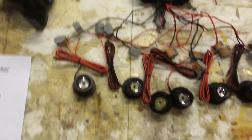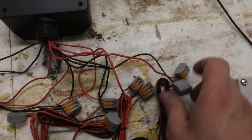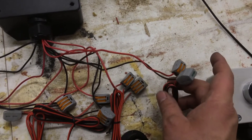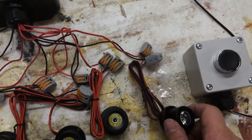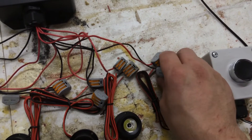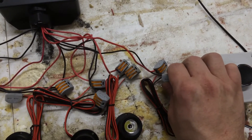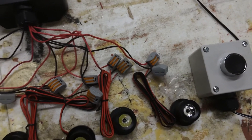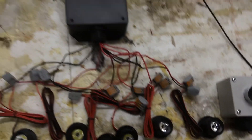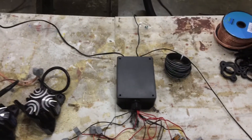The LEDs and most everything is connected using WAGO quick connectors. I have a red and a black wire from the control box to the red and the black wire on the LED. These only have a couple feet of wire — all you have to do is disconnect these and put another section of wire in between for however long you need them to mount from the LED to the control box. That's it.